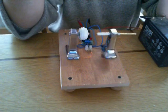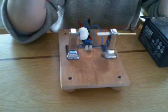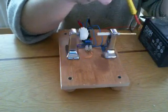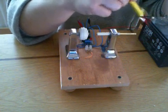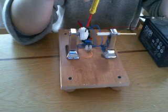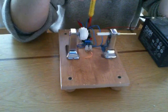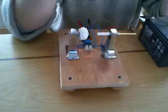What I'm thinking of doing is swapping that capacitor out for something of a much lower value — that way I'll get a bit of a higher frequency. One of the things Art did was a cool cam for turning this linear motion into rotary motion. But it occurred to me that if you just stuck a load of magnets facing N-S out and put that through a coil, it would function as a linear alternator, giving direct output without converting to rotary and then running another alternator. Art talks about capturing the back spike from the coil too. So improvements would include capturing the back spike, an array of magnets as an alternator, increasing frequency, and playing around with the mark-space ratio. I had quite a bit of fun building this — it took me most of the day. I hope you enjoyed the video.